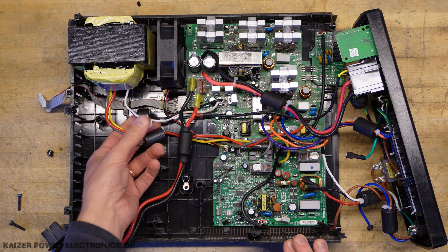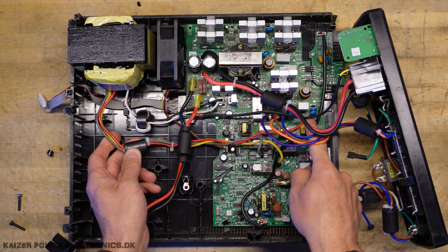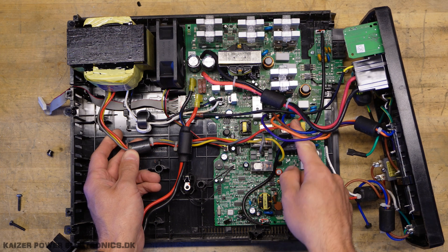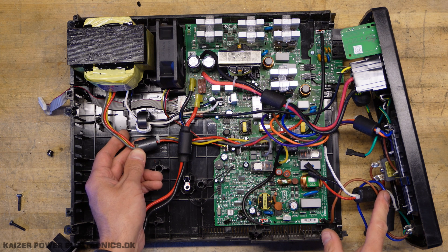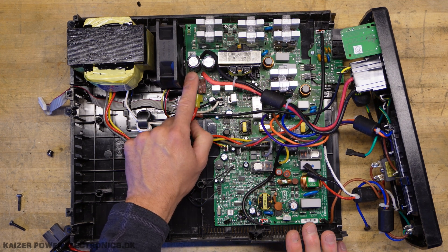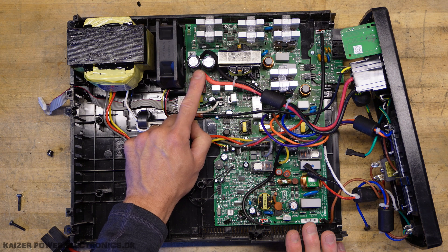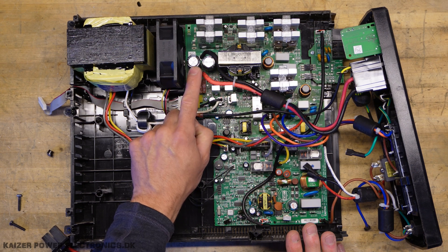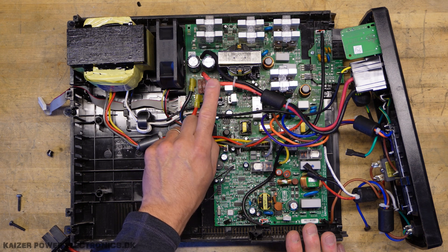The inductor mounts up with two wires over here, and we have three wires going over here which seems to be like a center-tap transformer, as we have one tap near the outputs and the two others sitting near the load connectors. Up around the switch area we have a transformer and two relatively small capacitors. So it's not a huge DC link intermediate UPS, but more like a mains-frequency modulated inverter. These are only 3300 microfarads at 35 volt DC, so we do not have a mains voltage DC bus here.